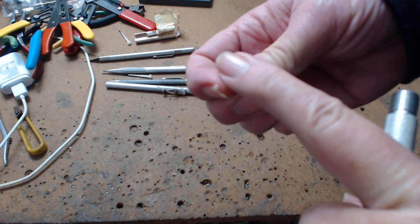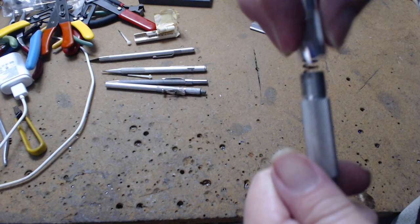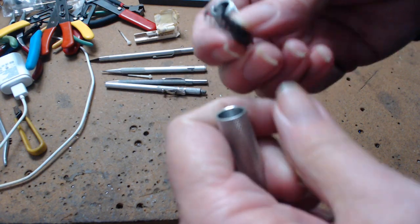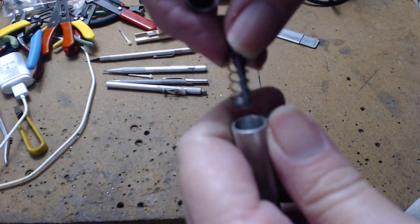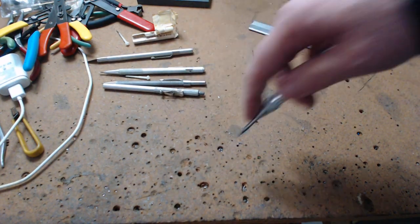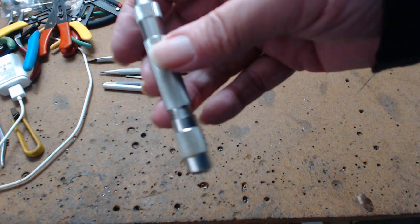You have to make sure that this stays nice and smooth and level. Because this other part, let me show you the other part. You'll never see this type of stuff on YouTube. This piece here would be the plunger. When you push up on this, this part starts to deflect and it falls through the hole, but it's under a certain amount of pressure. If that part doesn't stay level, it'll form a groove, and when you go to press down on this, it'll jump into the hole right away. So all you have to do is keep the backside of the plunger smooth and level, and the surface of the hole level, and this tool will work forever.